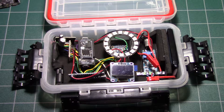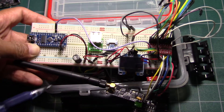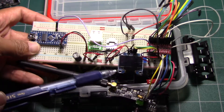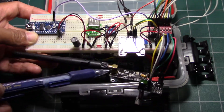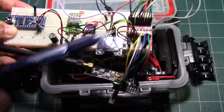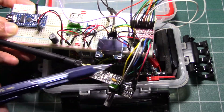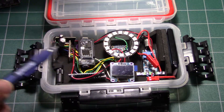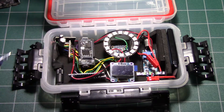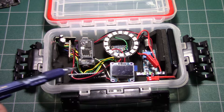Another thing I ran across: I soldered everything up because originally, as you can see, this is the prototype I had before — everything's just mounted on a breadboard. It worked when I left it alone on the ground and took the other module elsewhere. But as soon as I started moving and just wiggled the wires a little, the radio would go bonkers. I had to solder it to actually get it to work properly where I can move around and see the lights point in the correct direction. Breadboard — not so good. Soldered up, permanent connection, works pretty good.